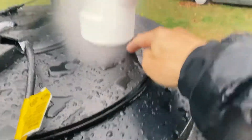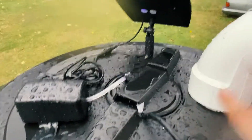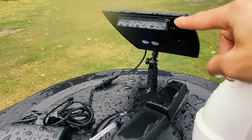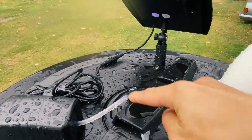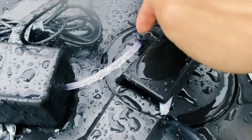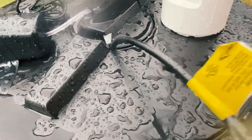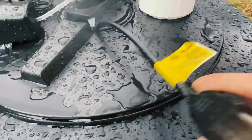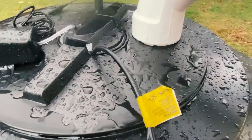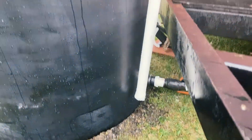I just drilled a hole in my 500-gallon tank. For winter, I set up a solar panel — it's a solar aeration system — so that keeps the water moving and helps prevent it from freezing. I drilled a little hole in the lid and a notch for when it's really cold. This is a de-icer that I just dropped right in. My overflow is inch-and-a-half PVC pipe. I put a little screen on the bottom so no bugs can climb up in there.